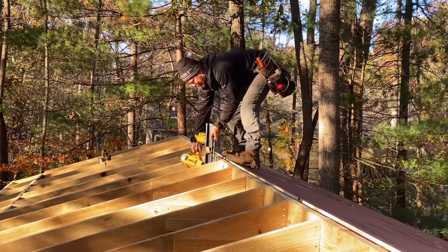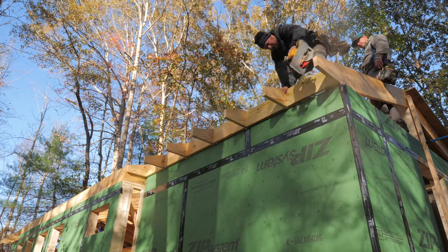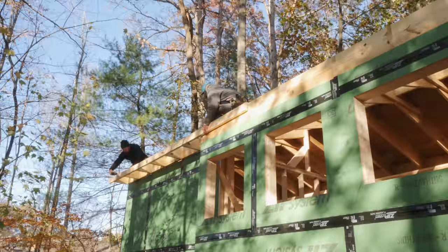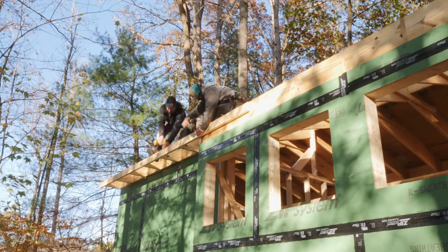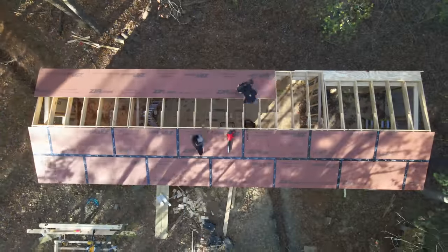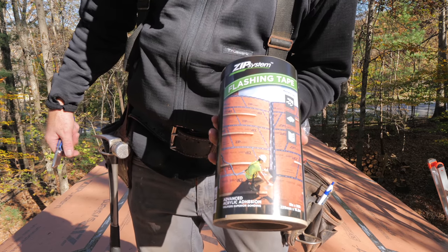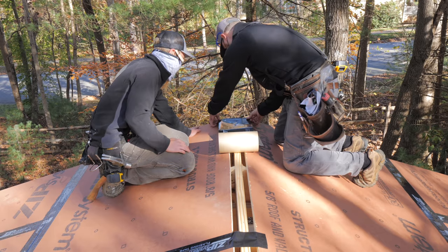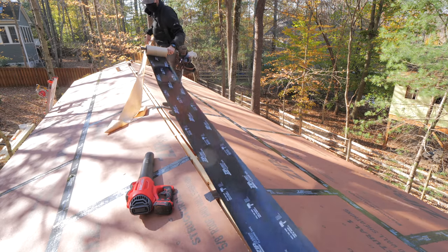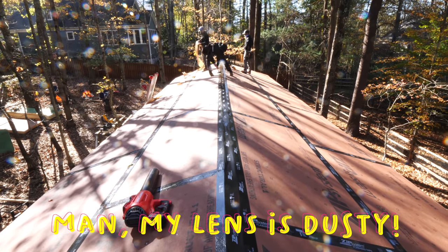Before sheathing the other half of the roof, Eric went back and added more nails connecting the rafters to the ridge board, since this area was easily accessible with half the roof sheathed. We then repeated the whole process on the other half — cleaning up the rafter tails, attaching the fascia — with the only main difference being that the fascia board attached directly on top of the blocking between the rafters on the back side where the house bumps out. We also went back and added a second layer of fascia here later in the build to give a bit of additional overhang, which I'll show in a future video. With the roof sheathing on, the only thing left to seal the roof was to close up the open area at the ridge vent. Since the roof wouldn't have shingles for at least a month, we ran a strip of nine-inch-wide Zip tape along the entire ridge — a 50-foot roll was nearly perfect for this roof. This was just a temporary solution; we will cut away this tape from the ridge vent area before adding the roofing.